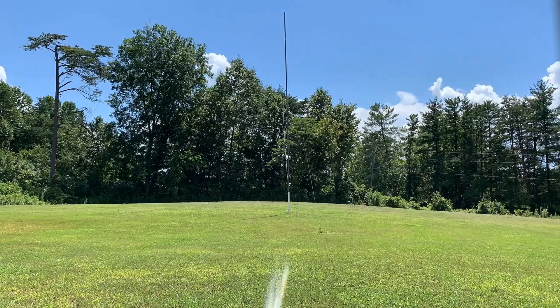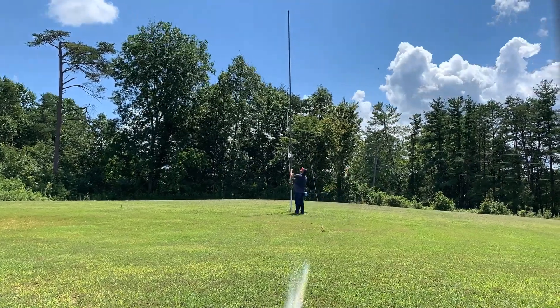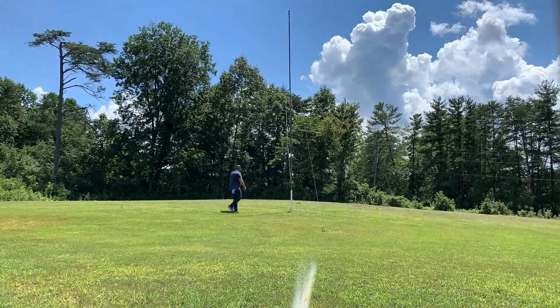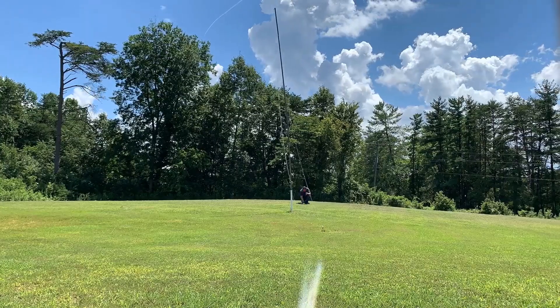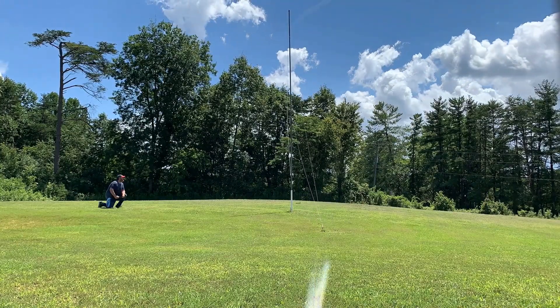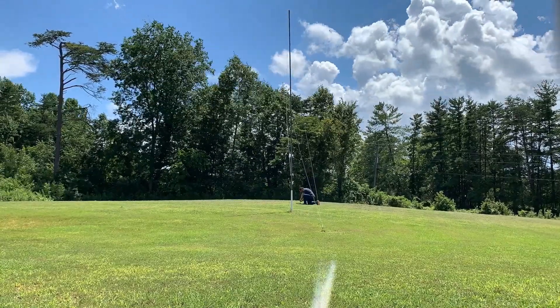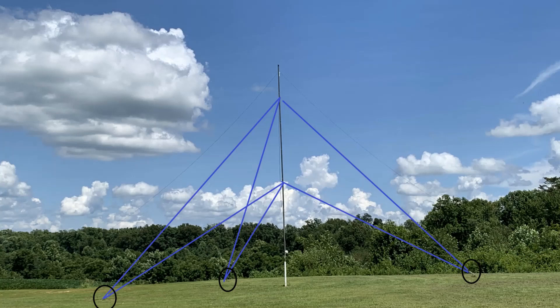Here's a picture of the anchor with the turnbuckle connected. Now I'm setting the middle guide wires. With the fiberglass mast being really flexible, the middle ones really help keep it from moving. Each set of guide wires are connected to the same point.